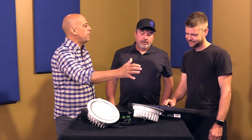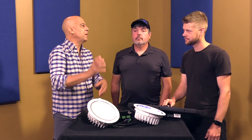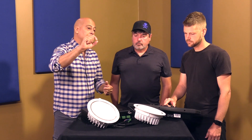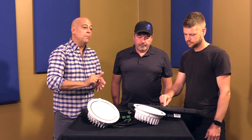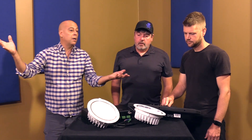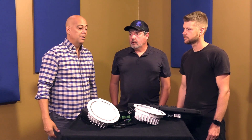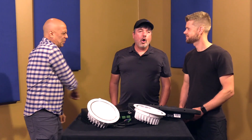Think about it — what other light can you make work that has DMX control and is low voltage? You can't. Even the stuff they sell at Home Depot still has some depth to it and doesn't dim pretty — it has that crazy stepping on the bottom end. What happens is as you're dimming down to like twenty percent it goes boop, and when you start dimming up it won't power on until it has enough voltage, then it just pops on. This is the perfect alternative at a price point you can afford.